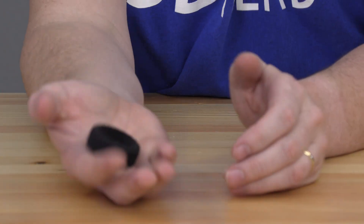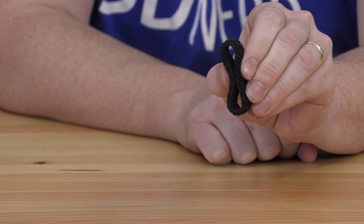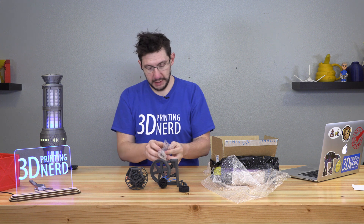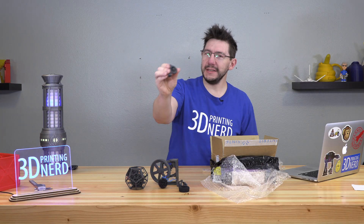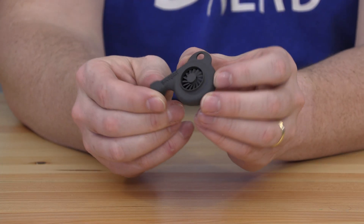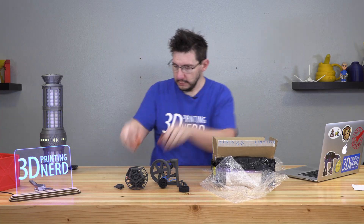Here's a tire — you can see the tread. Tread looks cool. The inside is smooth and it's rubbery, so you could print tires for your open RC F1 using an SLS printer and have some really unique tires that look awesome. This I believe is a turbo unit or an impeller or something. It's just amazing that stuff like this works — even if you used PLA material with some sort of PVA dissolvable support material at 100%, you're still not going to get the precision that an SLS printer offers.